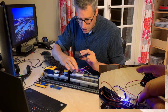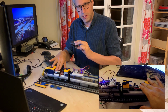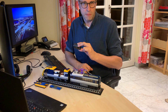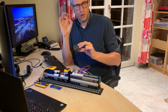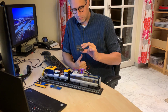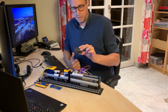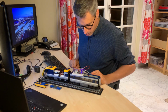And we've got one specialty for that controller as well. For the ESP controller here, we've got an analog input, A0, and we are measuring the voltage of the power supply here constantly when we operate the microcontroller. That's important because the speed of the train depends on the voltage of the battery pack, and that gets lower and lower when you operate the train, of course. So we are monitoring the voltage, and what we do is we correct the power that is applied to the motor for a certain requested speed in Rocrail, and therefore compensate for the voltage loss in the power supply. The outcome is that the train has always the same speed, even if the battery gets lower. That's obviously pretty important. So let's have a look if that all works.